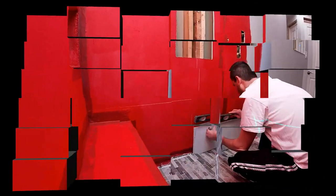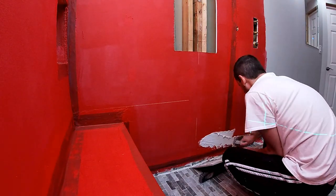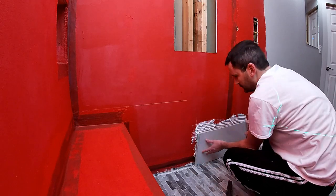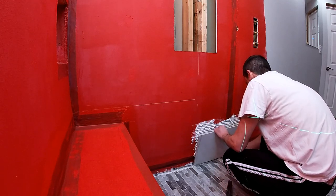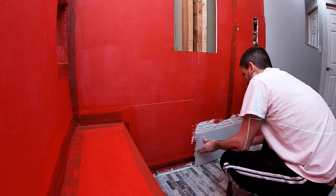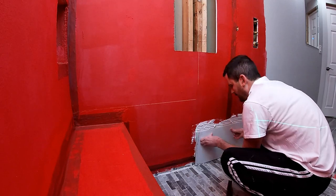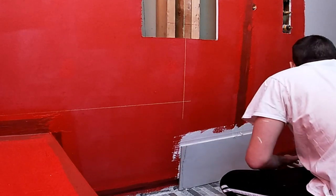It is vitally important that your first tile be at the lowest part of the sloped floor, so that as you go up you can trim off the excess rather than try to stretch a tile, which really doesn't work. Another important tip: make sure whether you're back buttering your tiles or going right to the wall, you've got a good quarter inch layer there to play with. It's not so much for tile adhesion purposes, but if your wall isn't perfectly straight, that layer gives you an option to really squish in a tile so they are laser straight and perfectly flush.